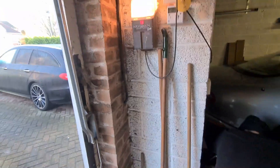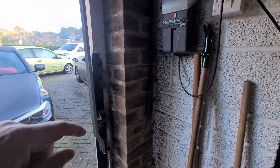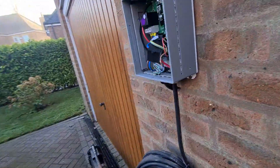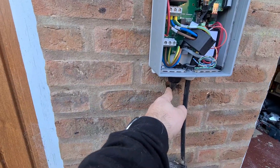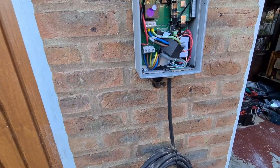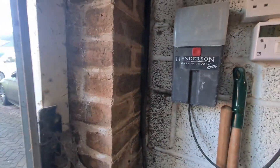You'll notice there's a central pillar on the wall that we've mounted the charge point on, so we've had to do some artisan-style angle drilling to get our cable through. If you drill downwards when installing your Hypervolts, you can get the bend underneath to an absolute minimum so when the front's on you don't see it - it looks like a rear entry. Using the Linean clips - they make a nice neat job of dressing the cable away.